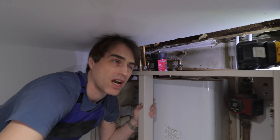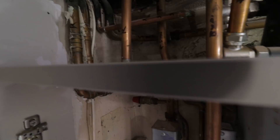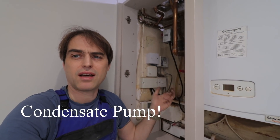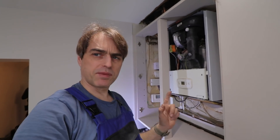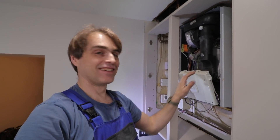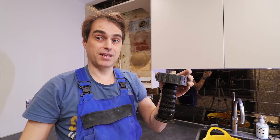Not bad, neatly done for a kitchen fitter. So we have a really, really terrible installation here. That's also an external wall, so they installed a condense pipe that goes up outside and then down — it's just pointless. I'm sure this boiler has been serviced every year. You can't remove that! A power flush will be needed on this job.